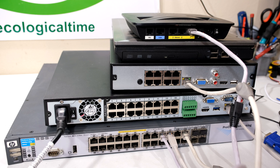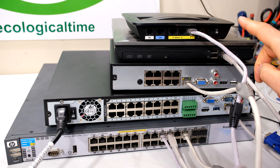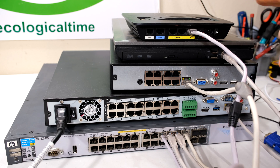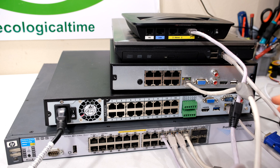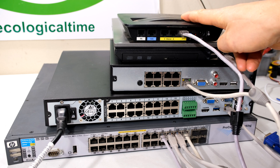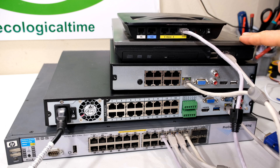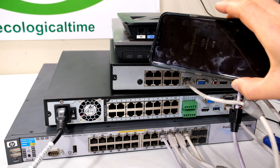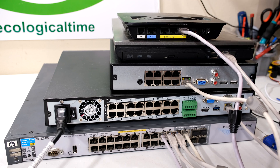You can set up the remote view using a laptop or computer using the web browser method. Your laptop would need to be connected to the switch which is connected to your NVR, and you will need the IP address of the NVR for this method. Once your NVR is connected to a router you would also have a Wi-Fi network available, meaning your laptop or phone could connect to your NVR via Wi-Fi through your router.